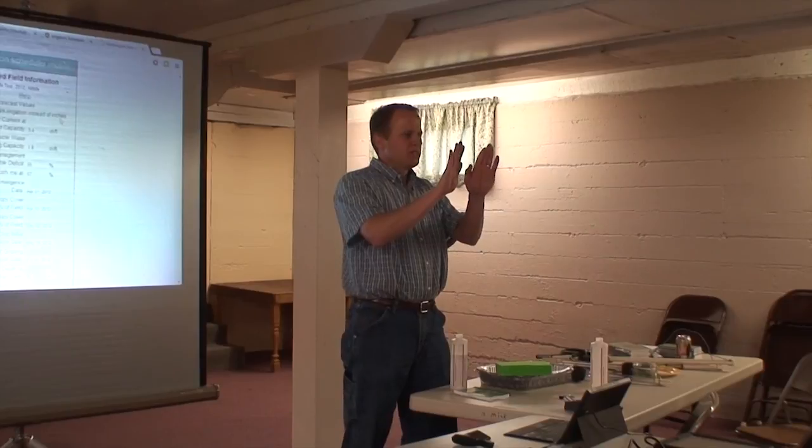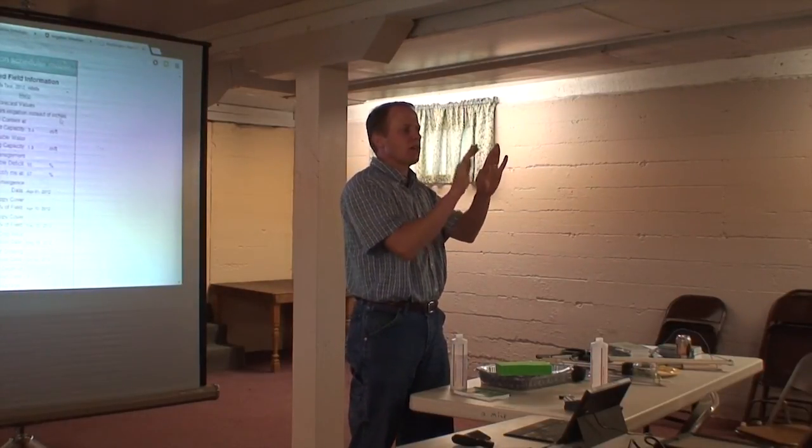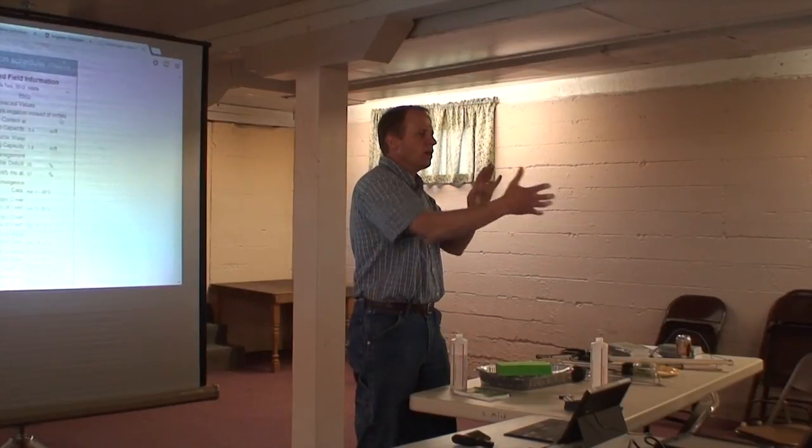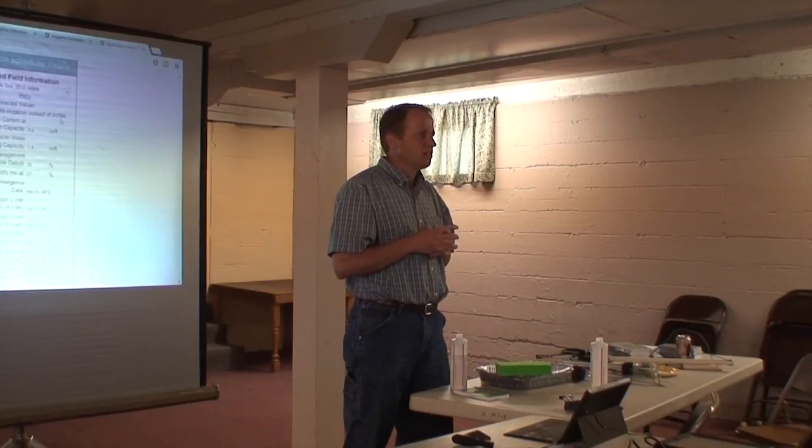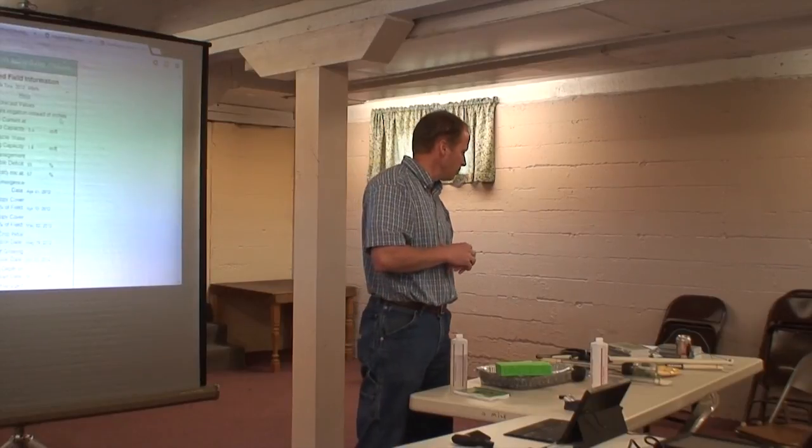But the bad thing about them is that because it's very highly influenced by what's happening right at the sensor, and it doesn't go out very far into the rest of the soil, it's very highly dependent on installation practices. And so they tend to be kind of variable, but they're repeatable. And again, since nobody really knows what a good number is to start at anyway, you just give yourself a little bit of feedback with that over time. But that will give you soil water content.